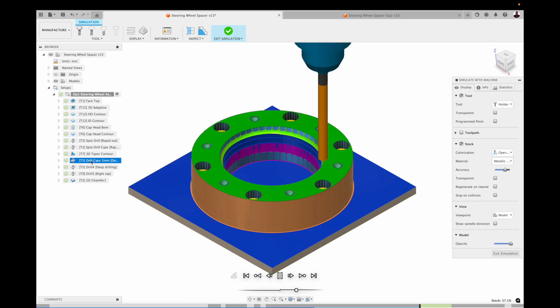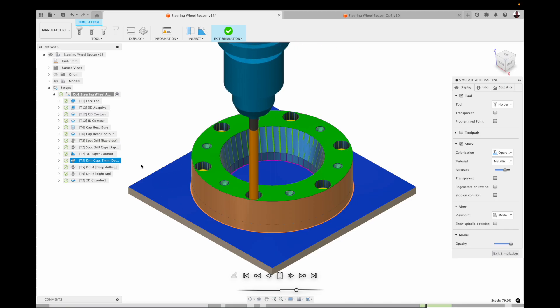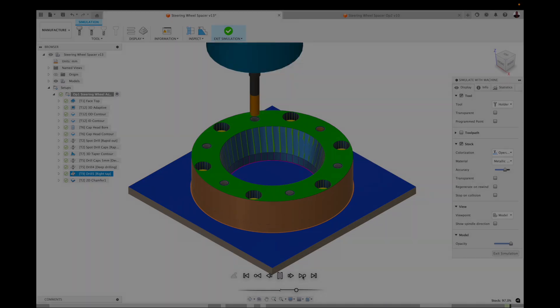Popping in with my drill bit — you'll notice here that I've got two tool fives, so unfortunately I have to stop the program at that stage and wait. You're seeing Fusion's simulation populate the rest of that 3D contour. We're drilling 5mm, and unfortunately after I finished that drill cycle, I did have to stop and change the tool out, because there are two tool fives and I obviously have to run a different height offset for that drill bit, then pop in here and rigid tap it.